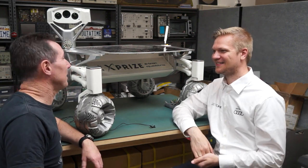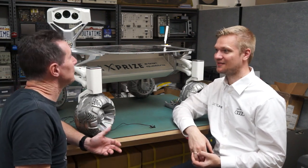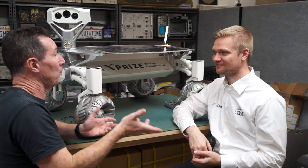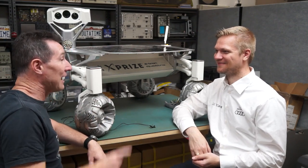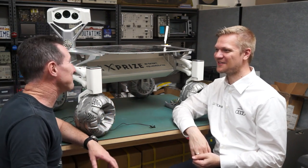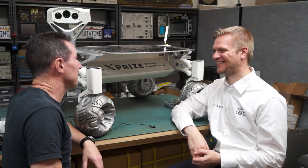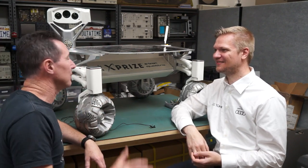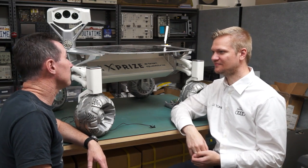Yeah, transients are a big problem. To measure your current transients you need specialized test gear. Whacking your amp meter on and hoping it goes up there, even an analog one, your needle can't move fast enough. This is how I killed my microcurrent. And it's not fast enough sometimes, with 500 kilohertz, 300 kilohertz bandwidth. Sometimes you can get really short current spikes that can really ruin your day.